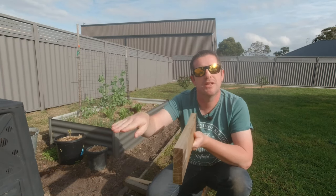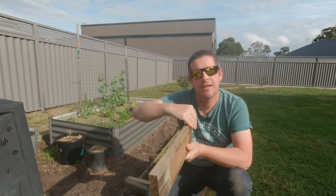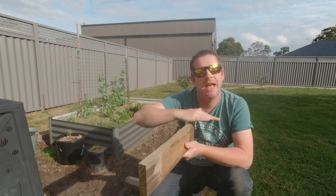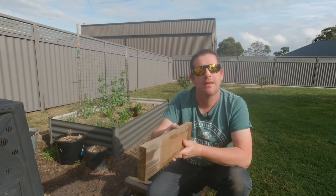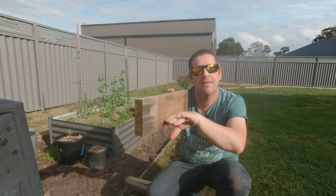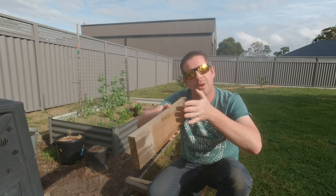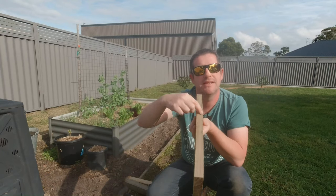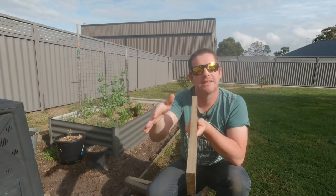The idea with that is you can run your garden mulch up to one side, have your lawn on the other side. You've got a nice mowing edge that you can whippersnip up to, and in our case, we can run the ride on over the top as well. If you've got it sitting up and your lawn down here, that's not too bad either. But again, you've just got more of an edge that in our case, it's harder to mow along, and it looks a lot neater if you just have this nice, neat little 25mm profile that separates your landscaping types from one side to another.